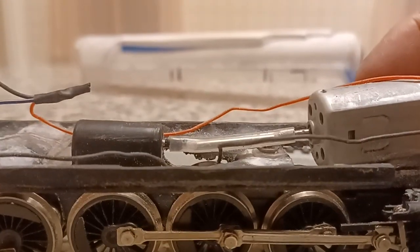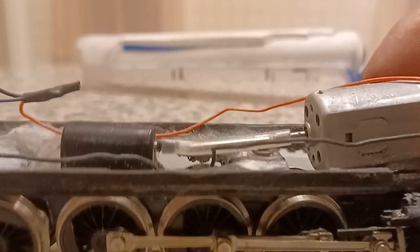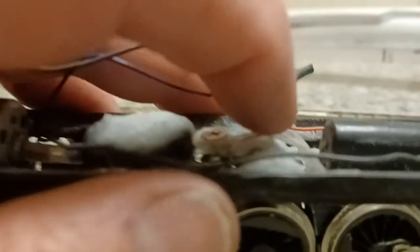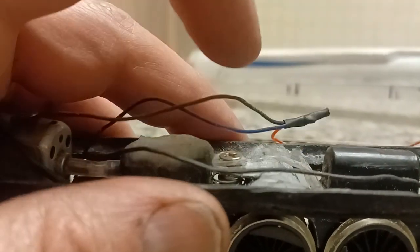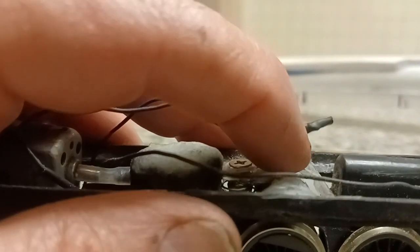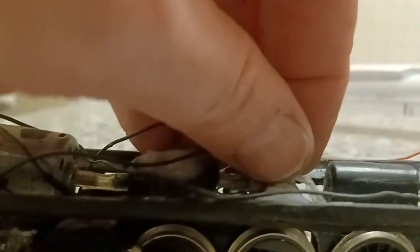So it made it a little bit front heavy. Now, the only reason why it's not really coming up off the ground is because I made a spring, a plastic spring. This is a piece of Lexan that I've bent. And Lexan, when you try to bend it, it will revert back to its original shape unless you overbend it. So this piece here is acting like a spring. You'll see it move up and down. It helps keep tension.